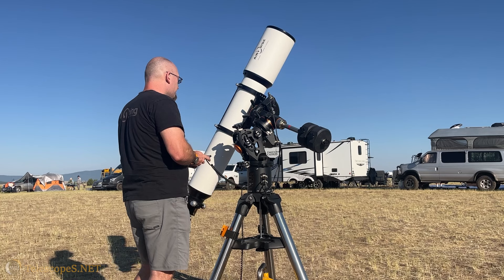So when you do the lens grinding, you have masters that you use during production. You can see the Newton rings — that's just glass on glass — and if they deviate too much, you can see it. We don't actually measure the real Strehl as a number during this process. You can make terribly good telescopes without doing this. All the scopes from 100 years ago, some of them are really, really good. All they did was use the knife edge, look at the stars, and polish.